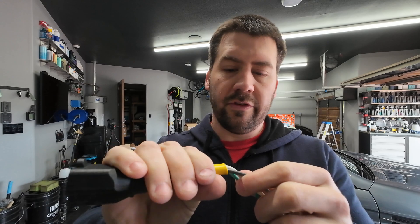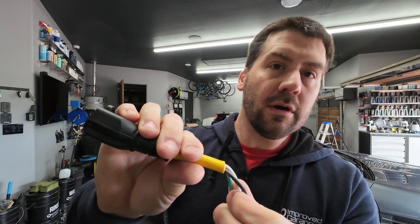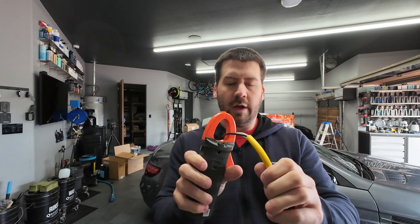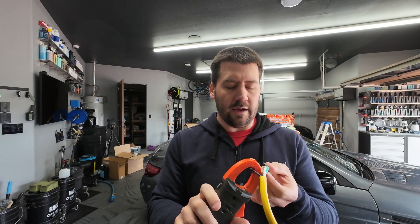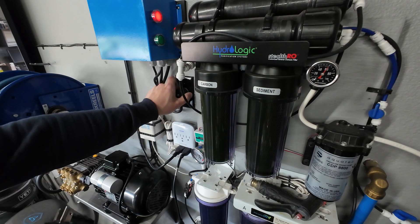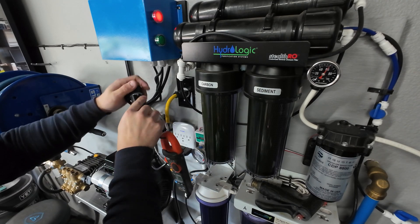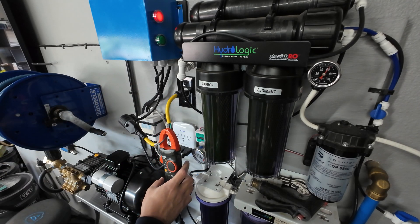Now you can see there are three wires. The first thing to do is visually inspect and make sure you didn't nick or cut any of the wires and have no conductors exposed. Then we're going to use the clamp on one of these wires. You can do either the black or the white, but you should use the black because the black is the line side and the white is the neutral — especially on 120 volts. On this one I have two lines because it's 240. We plug this into the pressure washer and now our power is going through so the amp meter can measure it without cutting or damaging the cord in any way.